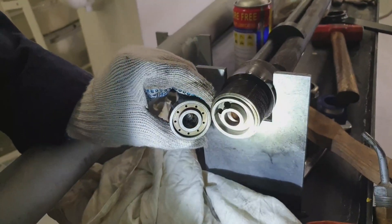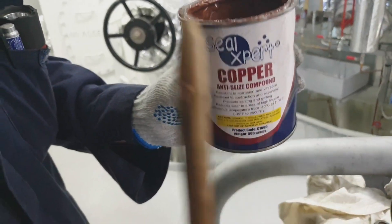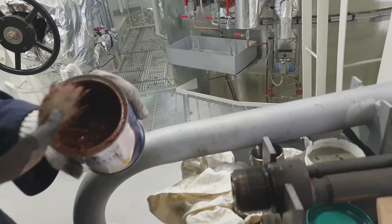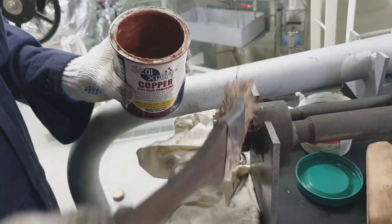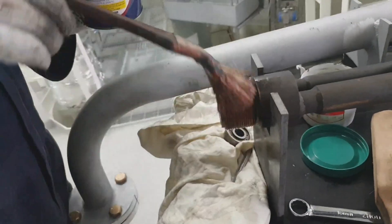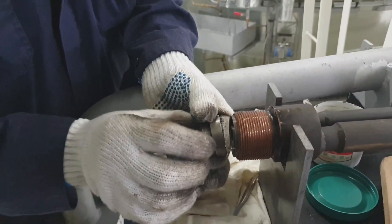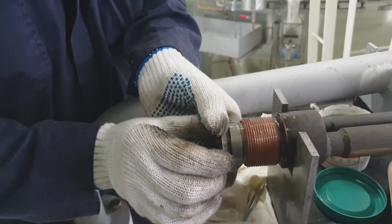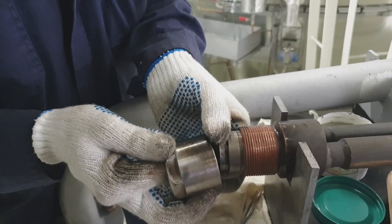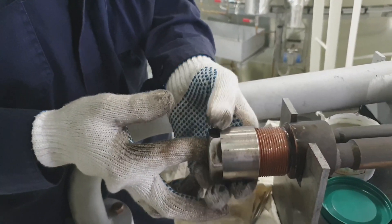As you can see, the face-to-face surface of both the sprayer and the burner assembly is now evenly clean. This is the anti-seize compound — I'm using it for the thread part of the burner cap nut, so just apply a little bit before installing the sprayer. Right now I am installing the sprayer, just to be sure no particles remain from inside, and now I am installing the cap nut slowly to press all the way down to lock the sprayer.